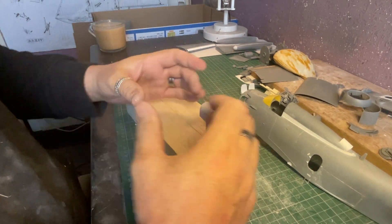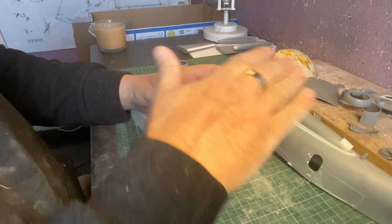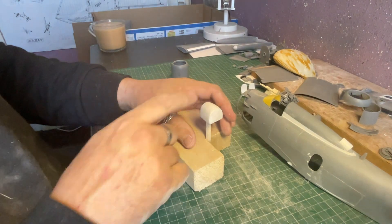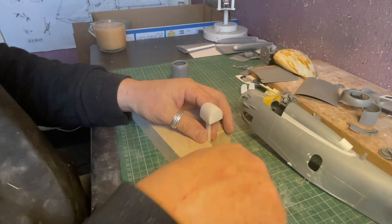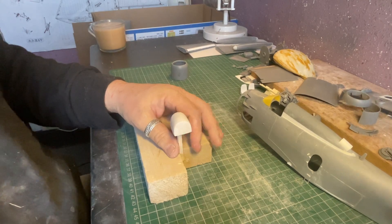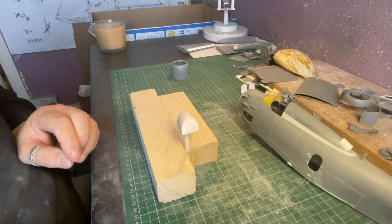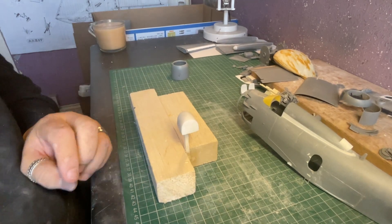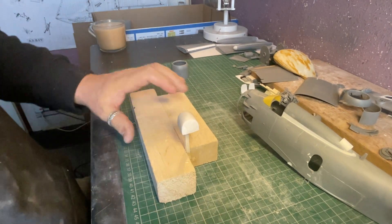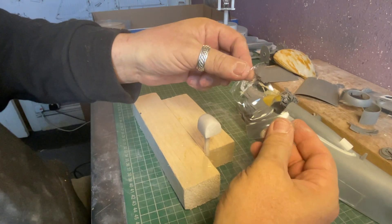There are a couple of ways of crash molding plastic. One way: you get the footprint of the shape, cut that footprint out of a piece of balsa wood, tape a clear bit of plastic around it, heat that plastic up, and plunge it through — that's probably the better way of doing it. But because I didn't have any large pieces of plastic, only some scraps, what I did was literally drape molding — pulling it over and just getting it tight enough.